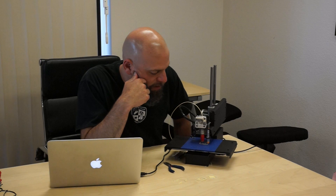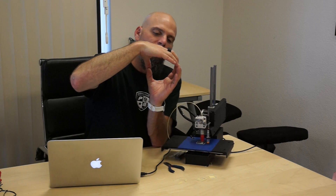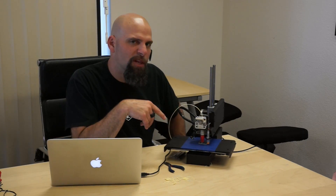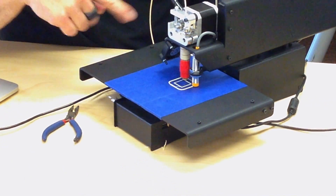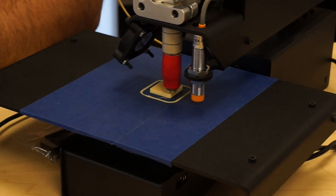It's actually going to stick pretty well, but I can see that when I look at the lines there's a little bit of air between them. It's laying two cylinders beside each other and they won't touch — but if you take that cylinder and smush it down a little bit, it'll overlap the smushed cylinder beside it and then you've got a solid layer. So: M212 space Z negative 1.4 — enter, M500, M501. I think we may have it. When it first comes out it might look a little light — it may take a full path around that cube before it really starts to flow and prime that pump, which it does two or three times on this particular print before going to actually do the object itself.